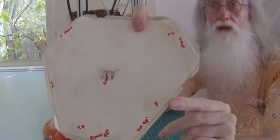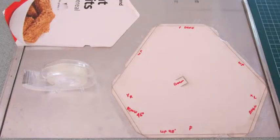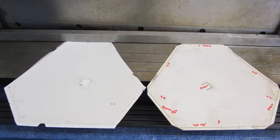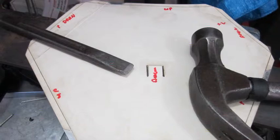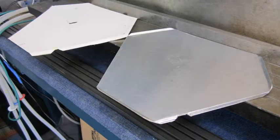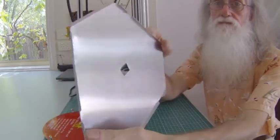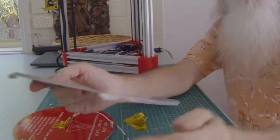I exported a DXF file and made a laser-cut template — you cut the main shape and only half-burn the fold lines so you can fold them. I got some shim aluminium, stuck it down with sticky tape, guillotined the corners off, used tin snips to cut the recesses that clear the nuts, and used a chisel the same size as the slot and hammered it on steel to cut through the aluminium. Then I used a folder to fold the edges up, and a vice for the other side.